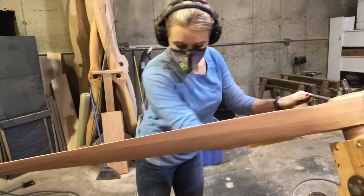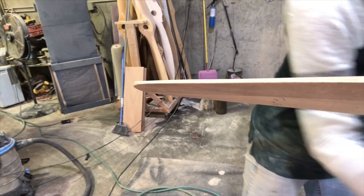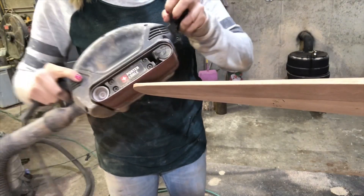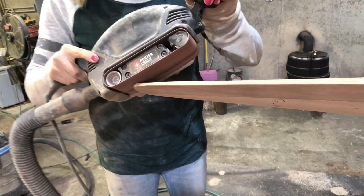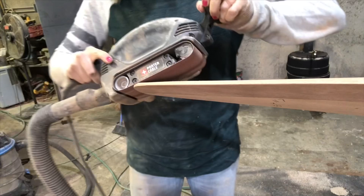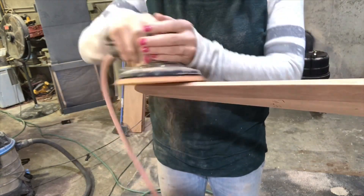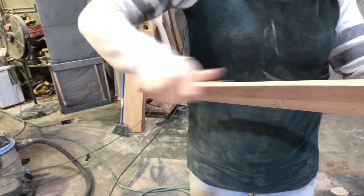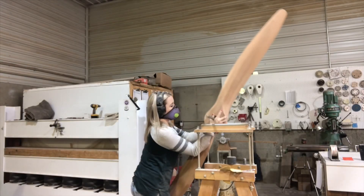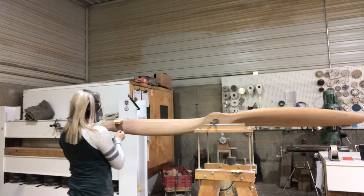The vintage mahogany look is just perfect for those planes. I'm always very careful about my trailing edge — you want it to be sharp, but not so sharp that it can be dented easily, yet sharp enough to perform well. Here I'm going to do the tips. The tips are a really important part too — round tips are generally quieter and probably a tiny bit more efficient. We thin these down with the belt sander and then go over it again with the orbital sander to take the lines out. You just want to thin those down so they go through the air smoothly. The tips are going to be traveling roughly 750 feet per second at cruise and can get up to 850 feet per second at max RPM.